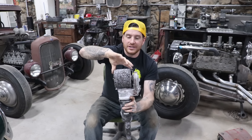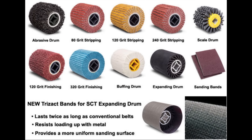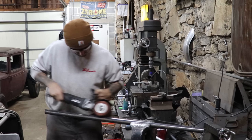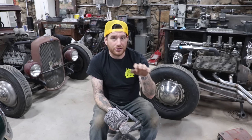With this, you're able to push down and take out wide bands of material really quickly. After stripping, you can switch the drum out — there are a bunch of different drums available. The tool comes with a finishing drum that is basically a Scotch-Brite type material or scuff pad, which is really good for conditioning metal. You may see in some videos where we take a piece of sheet metal that has flash rust on it from sitting in the shop — we'll strip off the surface rust to get nice, clean, fresh metal that we can work with, so we're not running a rusty part through the English wheel, bead roller, or any other tools.